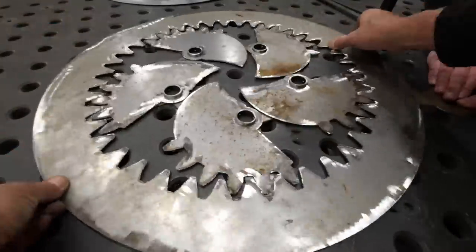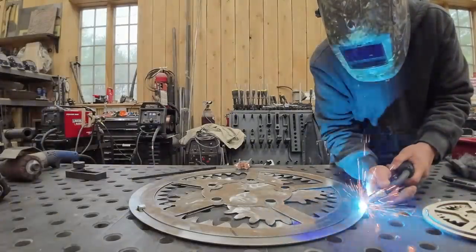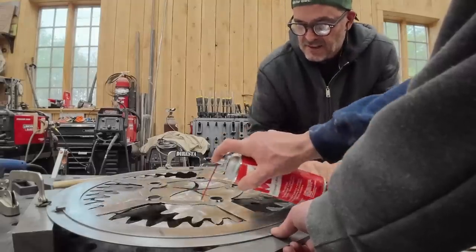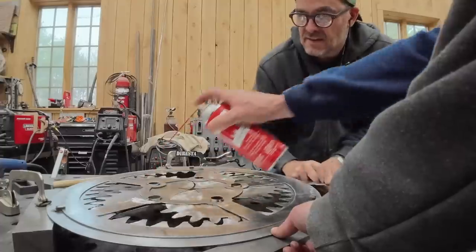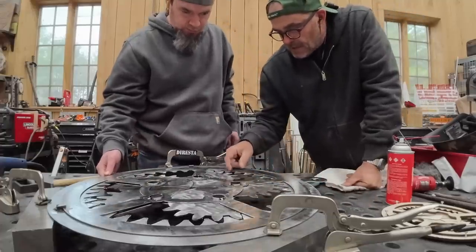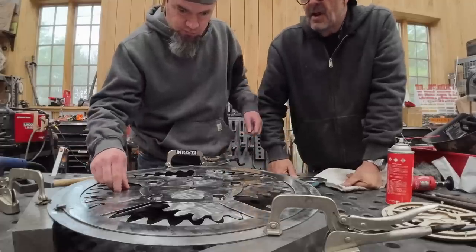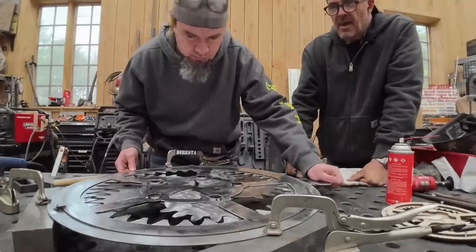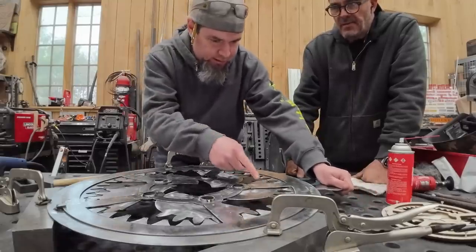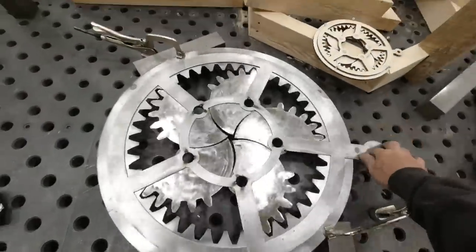I don't even know if I ever told Matt this. You can see it's starting to get some movement there, which is pretty cool. Once we start adding the layers, though, it creates friction tremendously. So we need to spray it with oil — I'm using an M1 from Starrett. This metal is from a buyout, a shop buyout. It is all a certain type of tool steel that Stanley framing squares were made out of. It's very springy, brittle — it'll break if it bends too far. I got about 10 sheets of it from a junk collector. They're all 12 feet long by 32 inches wide, all meant to make framing squares in a Stanley factory from Massachusetts.